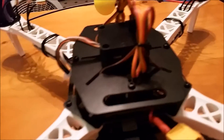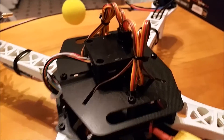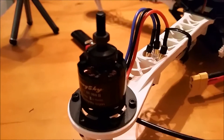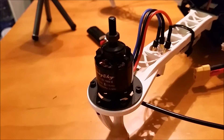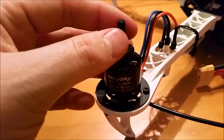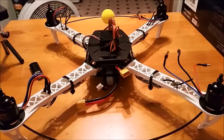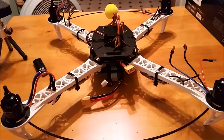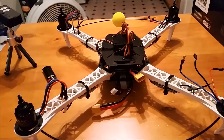I don't have the motors plugged in yet because I'm still waiting for my banana connectors. So we've mounted the CC3D board, cleaned up the wires, connected the ESCs to it, and installed the Sunny Sky 2212 980 kV motors with the stock mounts — not the ones that come with the motor. We've also stuck on the prop adapters. I'm still waiting for my props and those last banana connectors before I can do the final ground station setup for the CC3D board to get this baby flying.